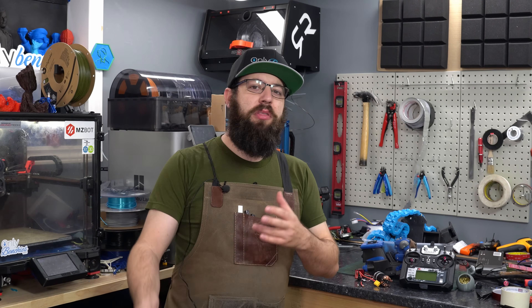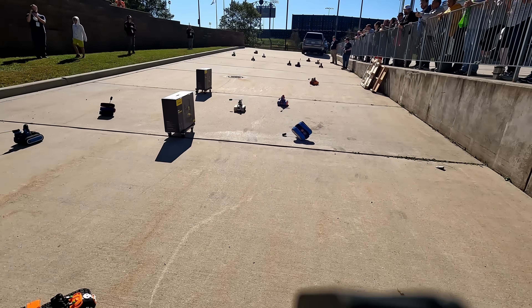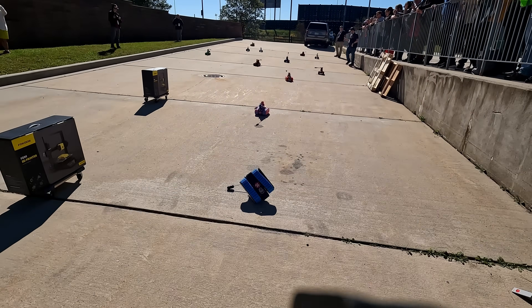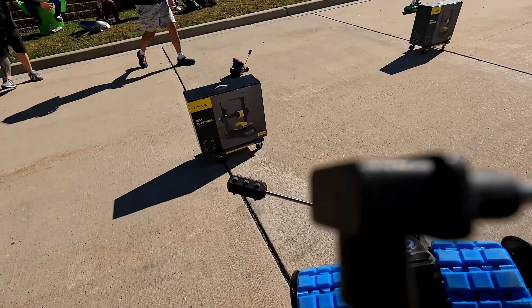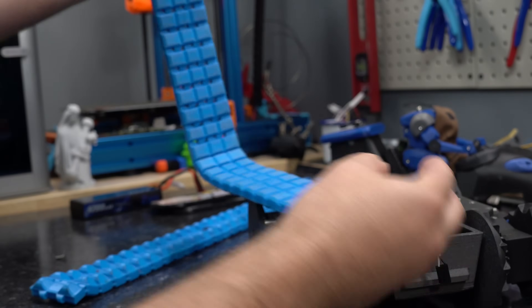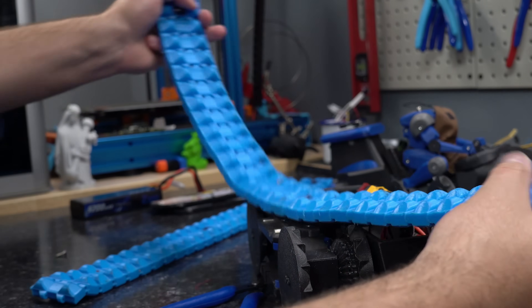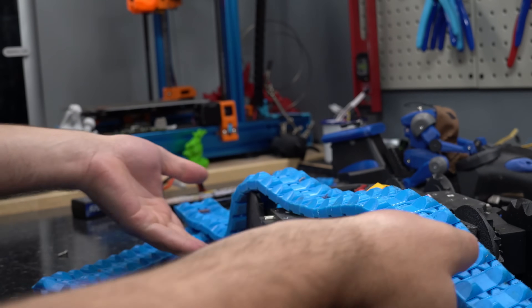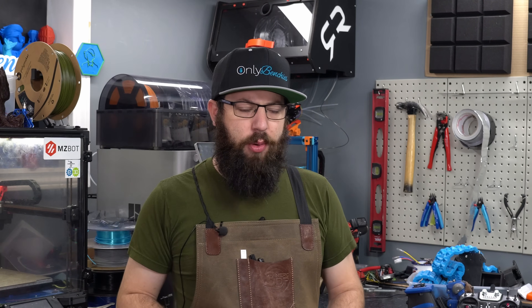After the teardown, a few things are kind of obvious. One — I was really impressed by how well the TPU treads held up. By the end of the second day, I was getting some track slipping on the drive gear. I don't know if that was from the tank treads starting to loosen up and stretch, or if it was just my drive gear system falling apart. But physically, just looking at them, they've held up pretty well. I'm impressed with the TPU tank treads — those were printed out of Polymaker TPU 95A filament, if I remember correctly.